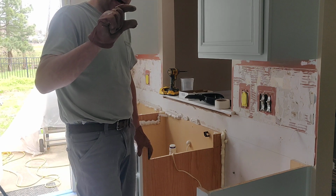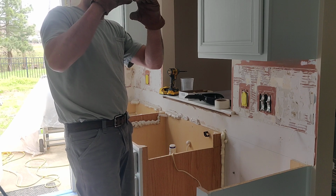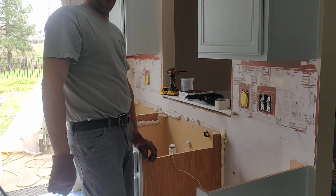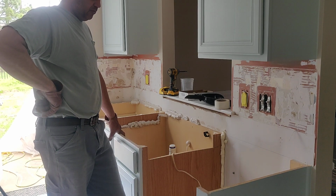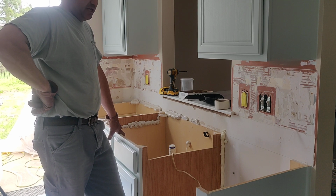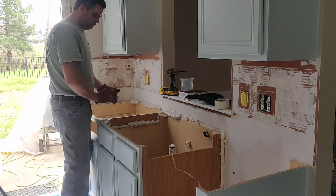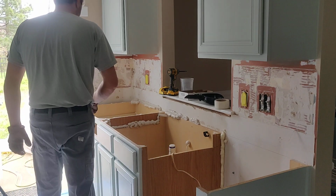And if that gap is too high, where you got your bottom stud plate, and sometimes the sheetrock is only coming down right to it, there might even be a gap there, depending on how they hung the sheetrock in. But so that's where they come in. They come in behind that stud wall because it ain't sealed at the bottom. So if you're building a house for yourself, ask them to seal them cabinets.